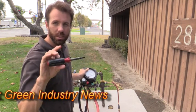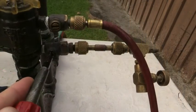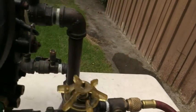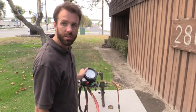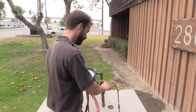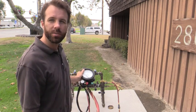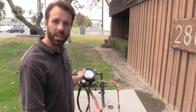I'm going to go ahead and compensate for that using my screwdriver and opening the number 1 test cock. I'm getting my gauge to drop now. I'm looking for my air inlet opening point. Right there — at 2 psi. So this indicates that I have a leaky number 1 shutoff valve, which I was able to compensate for.